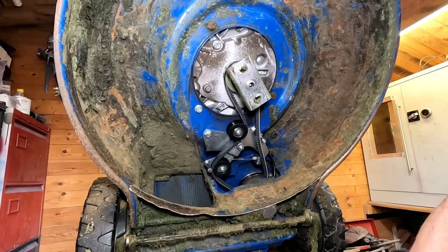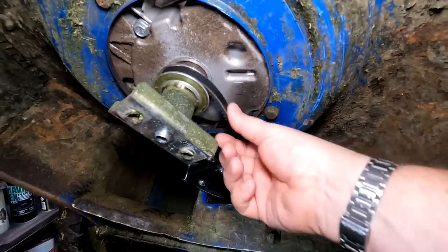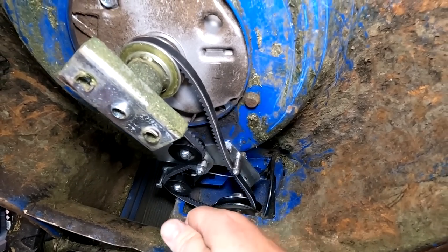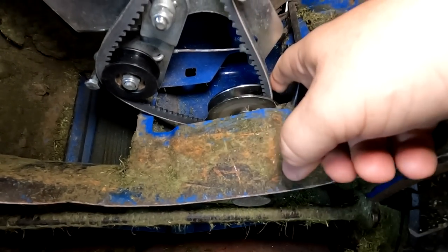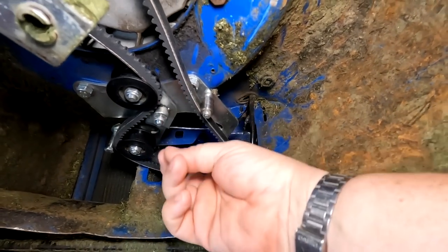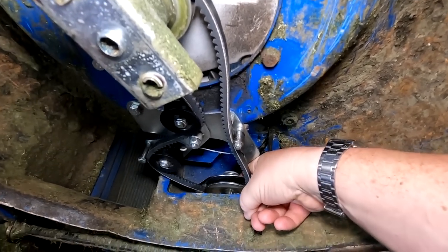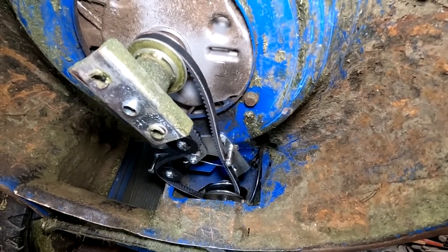That should bring everything under tension. We will be adjusting the belt — that looks like the position of the belt in place. The belt is now on, it's in fourth gear at the moment just to put a bit of tension on it. You might wonder how this speed control thing operates. This lever pivots on that pivot point from first to fourth. But if you look at the actual pulley, it lifts up — it's on a spring-loaded thing, spring tension. There's a spring up here and it actually opens up and closes like a variator. So the belt moves up and down depending on what pulley speed you choose.